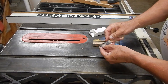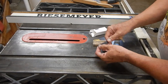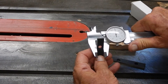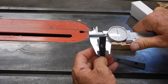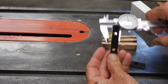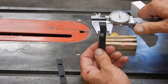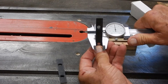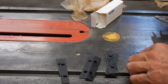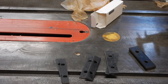This is admittedly a rather cheap set from China, but they look alright. The half inch set is half an inch at both ends. That's good. Let's check the other one. That's about a thousandth under on the 7/8ths, but they're both the same and they're both the same at both ends. So I think I can live with that.